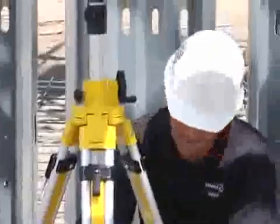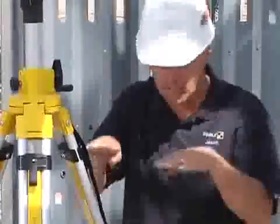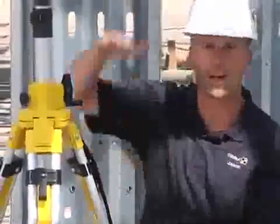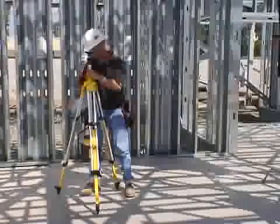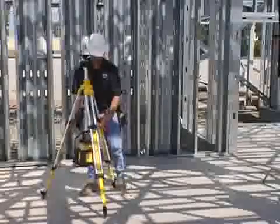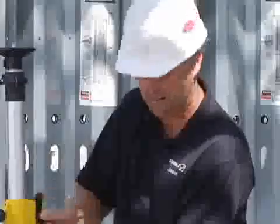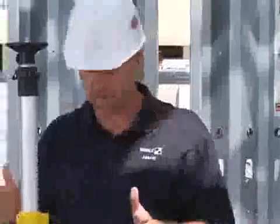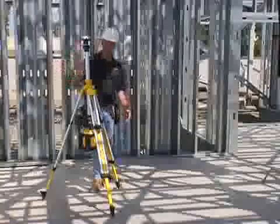And what that means now is after the laser's level, I can mount this laser at a height of as low as 10 inches or to whatever height that I want. A typical benchmark would be 3 feet. All you have to do is raise the legs up a little bit, spread them out, and I can raise my laser until I hit my 3-foot benchmark. The other great thing about this tripod too, though, is the legs are protecting the laser. So as people are dropping steel studs, things are happening, my laser is protected.